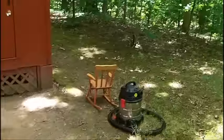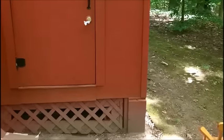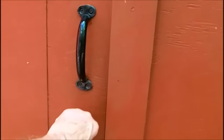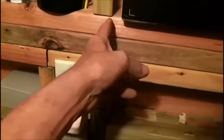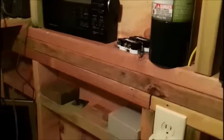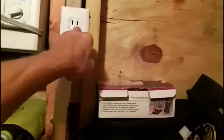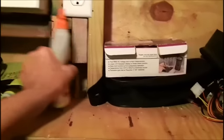This is the second day of electrical work. I just got to running 12/2 Romex with ground. I got the air conditioner on in here. It wasn't easy drilling through triple two-by-fours, and the reason this shed is made this way is because it was made with cutoffs - bargain wood from Home Depot. I should have spent a little more money and put a double header up here, but that's beside the point. Running 12/2 with ground all the way through, all the way down to the workshop bench equipment, and then the wire runs down into here.